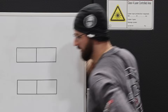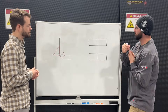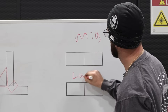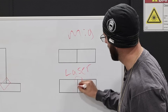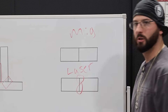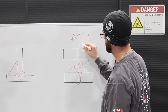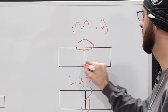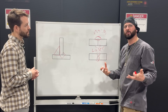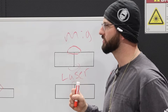We're going to have some three-eighths plate today and we're going to do the same kind of test — one with MIG and one with laser — just on these butt welds right here. We're going to put two welds in and try to get complete joint penetration with the lasers. The MIG is going to be mostly all sitting on top. This is what we typically expect with these processes — that's what we're going to unveil today.